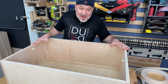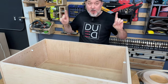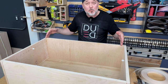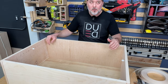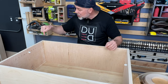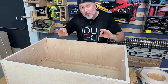This here is your basic cabinet box. The easy part is edgebanding two of the sides, but then you have the two other sides. There is a space between here and here that you have to butt up against, and you have to cut your edgebanding to be exactly perfect — not one hair too short. Because once you make that cut, if it's even a hair too short, you've wasted an entire piece of edgebanding. You're not going to want to see a gap here or here.